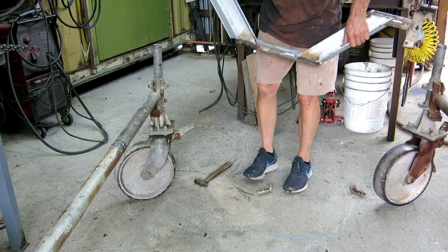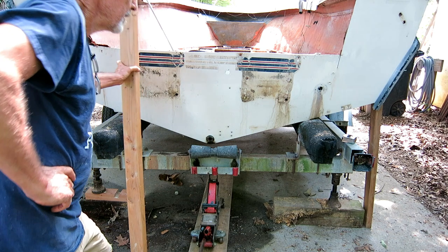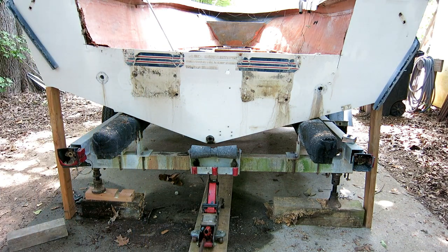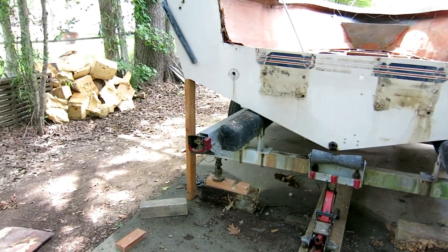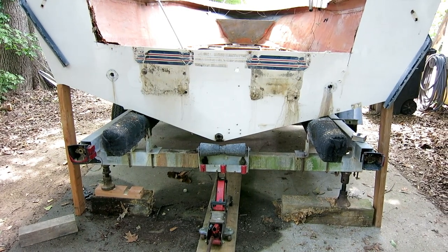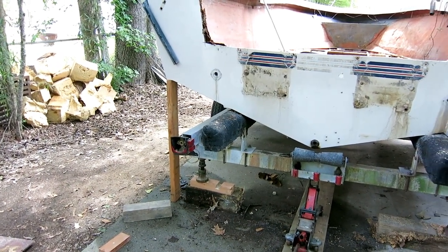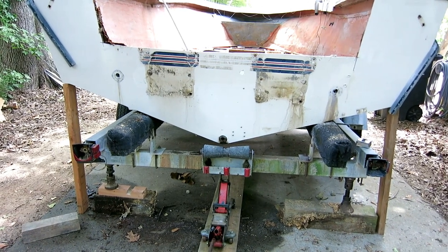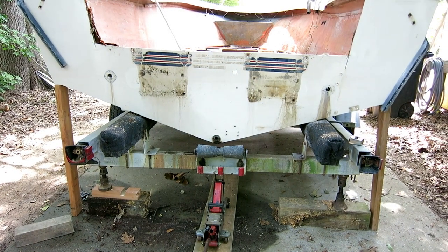Now I'm lifting the boat to put the dolly under it. This would have been easier if the boat stuck out past the trailer, but the trailer sticks out past the boat. I picked up the trailer with the boat on it using a floor jack in the middle, then the floor jack was in the way, so I put a small bottle jack and a screw jack on each side. I can now lower the floor jack, get it out of the way, put crisscross braces on the two-by-fours, and when we let the trailer down, hopefully they'll hold the boat — it can't fall to the ground because the trailer will still be under it.